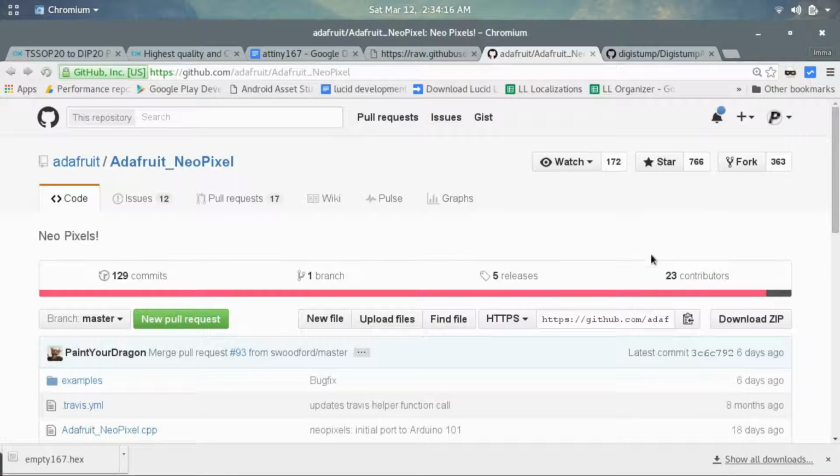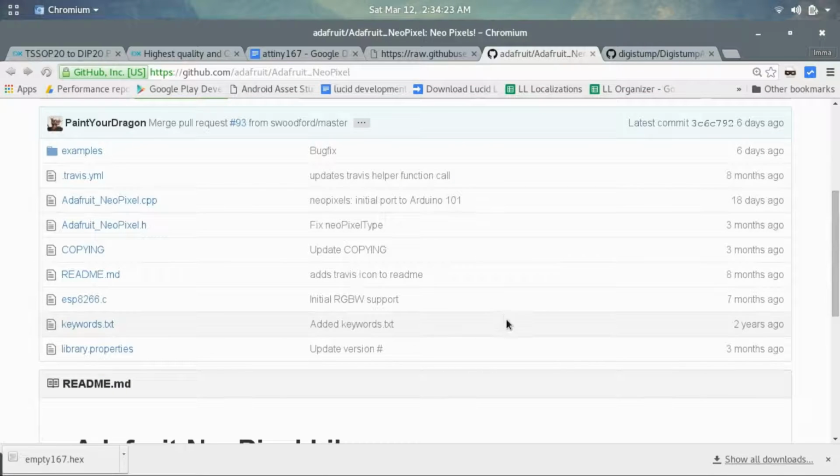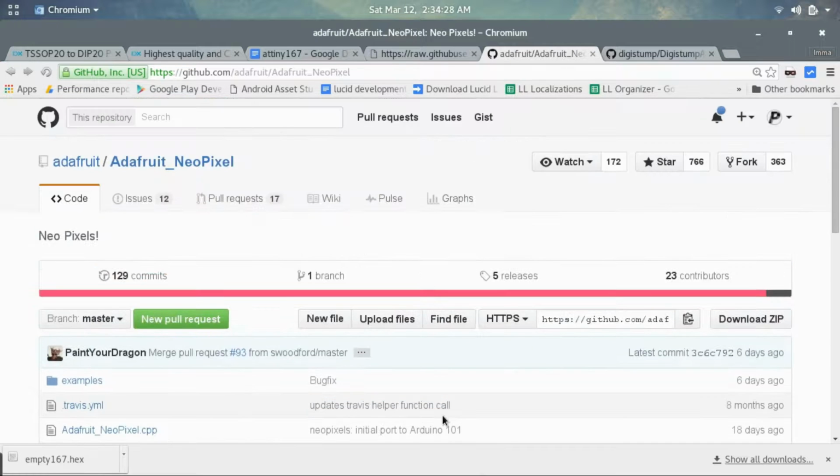Now we are going to go into a bit more complicated example, just so I can show you all these external libraries that will work for the ATtiny167. The first thing is we're going to test out the Adafruit NeoPixel library with an Adafruit NeoPixel 12. So what we're going to do is go ahead and download this library from github.com/adafruit/Adafruit_NeoPixel, and this is going to be in the description as well.